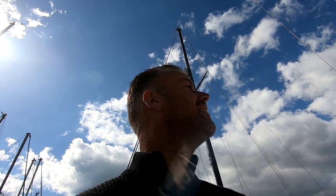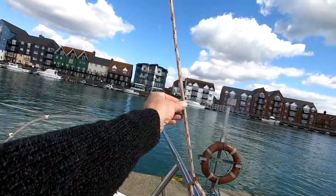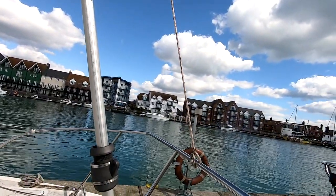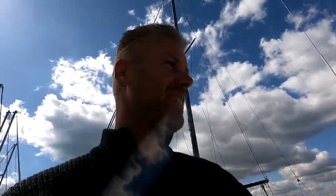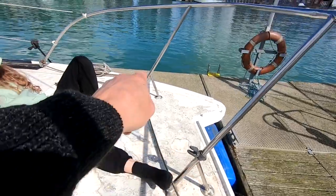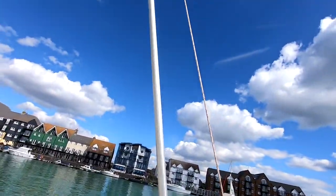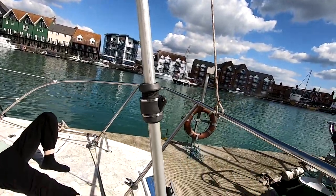Something else I found on the foresail when I was putting them up when I first bought the boat - a few of the smaller battens are missing from the foresail. Before I rehoist it I'll see if I can source some small battens so I can have it fully battened out. I'm also going to replace the halyard because that's a little bit knackered. I'll buy a nice new halyard and use the old one as a sheet. I may well treat myself and get some new sheets - I've already got nice new 6mm rope to go on the furler. I'll get them all the same, get it all looking nice and running smoothly so when I want to slow down I can - I'm not going to be getting whipped in the face by the foresail trying to tie it up.